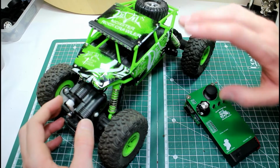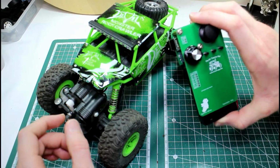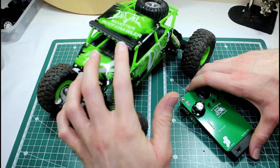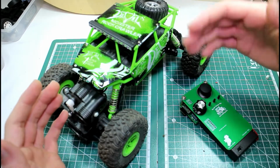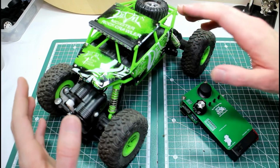And by doing this little conversion, although it's pretty simplistic, it did highlight an issue that was on the controller here. When I first programmed it, I could see the LEDs that flash here. When I turned on the controller, the speed at which they flashed was slowed down, and that was because this was sending commands to the controller way too fast.